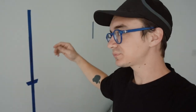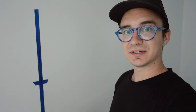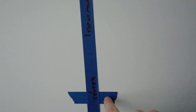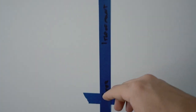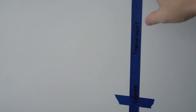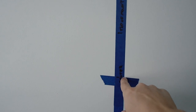Let me show you what I did here. I have the measurement of how wide the cabinet is, here to there. This is the measurement of exactly center, and then I had the measurement which is center between the bottom of this and the top of the TV cabinet. So this point right here is perfectly centered vertically and horizontally. Then I took this long piece of tape, measured the TV, divided that by two to get the center, and matched up the center line exactly with this tape.